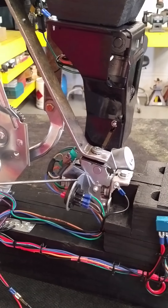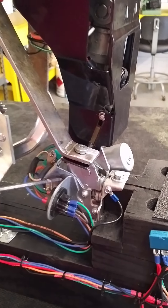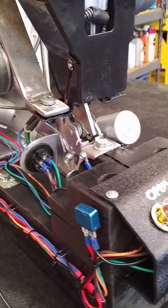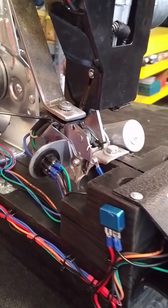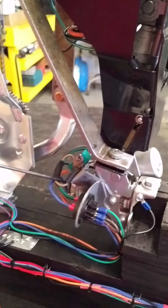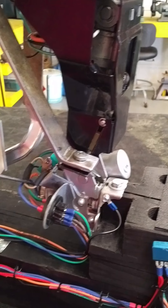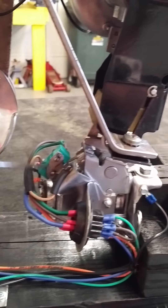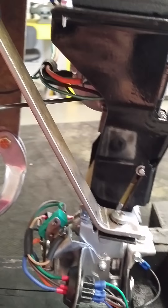This is your latching assembly. This latching assembly also has involved with it a limit switch, which is this green block. A rear control from the key, which can open and close this trunk lid assembly outside the vehicle. And then you have the drive pull-down motor assembly.